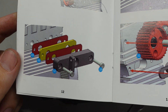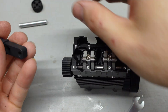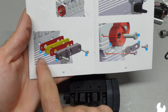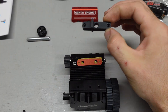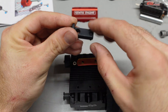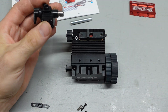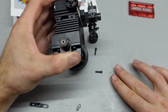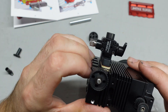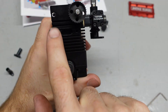Next step is putting on the carburetor support plate — this piece here — and then here's the carburetor itself. We install the support plate with its bolts, torque the carburetor mount down, then add a little O-ring to the carb and seat it in place. Put the two bolts in — a little tricky, it's tight in there — and the carburetor is completely mounted.